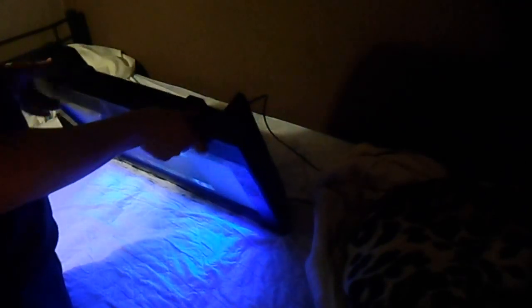Let's turn it on - it's upside down as well. Now we can see it's going to be working and it lit up. You can see the relatively poor contrast ratio of this crappy LCD panel - and a very, very poor viewing angle. That's a pretty awful viewing angle, it's only a TN panel - what you'd find with most computer monitors and laptops. Cheap as chips really, as cheap as you can get them.